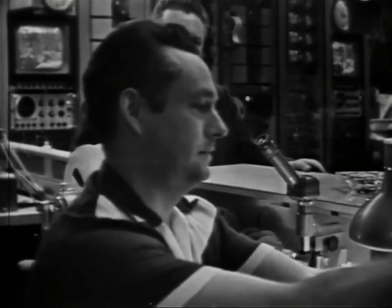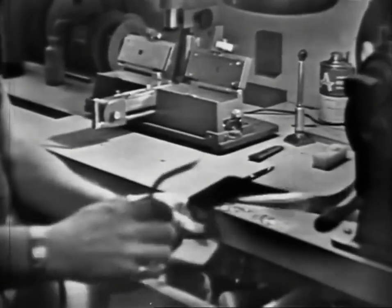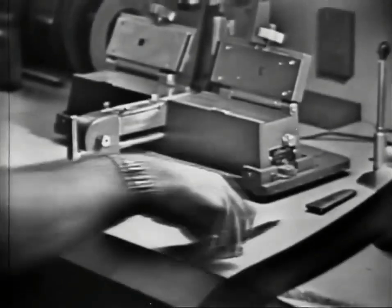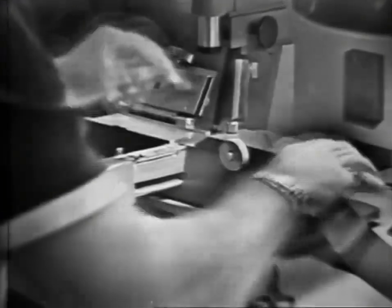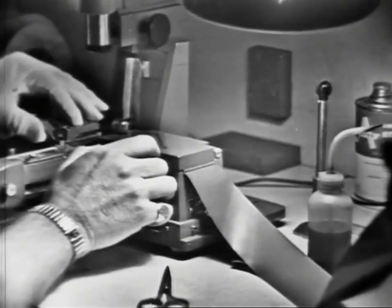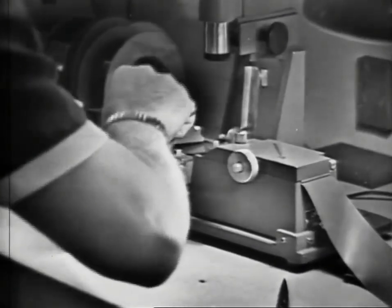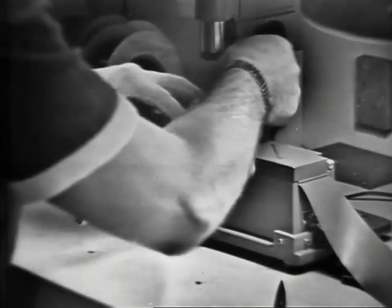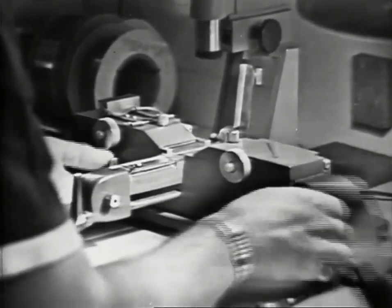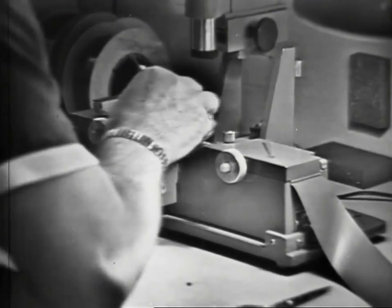We're now back with Ray Darby, who is taking the tape that you saw passed across. He will develop with the carbonyl iron solution, find the edit pulses, and make the physical splice on the SNS splicer. This bottle that Ray has is merely a plastic bottle with a siphon tube. The carbonyl iron is mixed with a lacquered diluent and mixed well to suspend the carbonyl iron particles. As he squeezes this bottle, it forces the solution out across the tape. The magnetized portions of the tape cause the carbonyl iron to adhere, and therefore presents an actual picture of the recorded information.